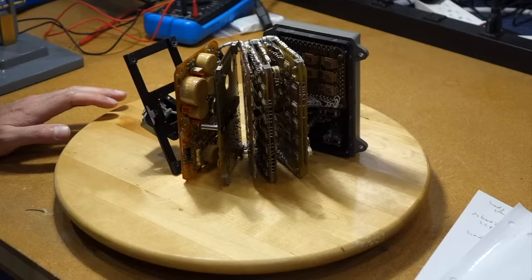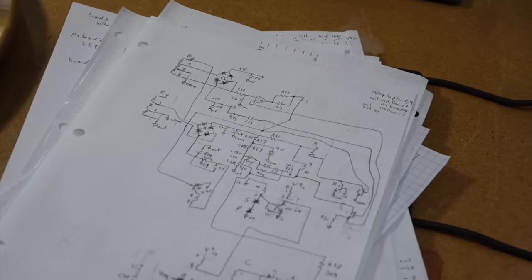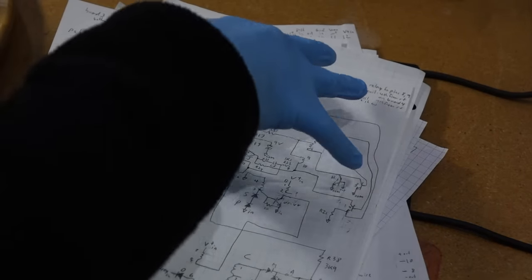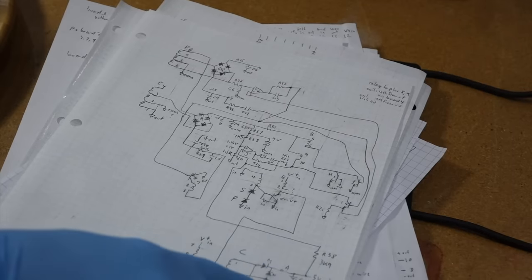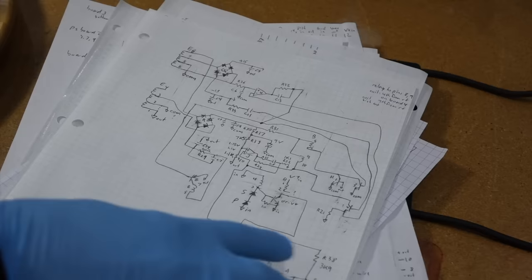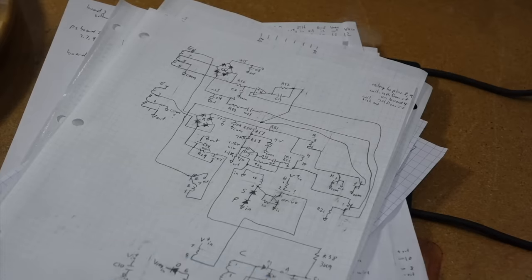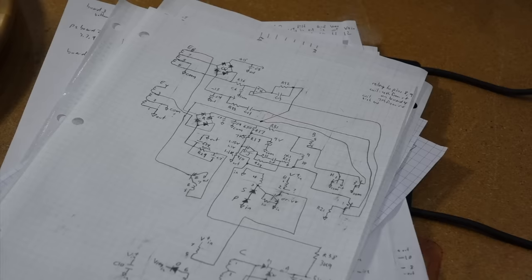Okay, and it's a switch power supply. Yeah, which makes it efficient. So this is about half of the power supply here. This is the control circuitry. And then here is the output for the 5 volts, which is a fairly standard forward converter on the output side, except they have two outputs in parallel, which is a little unusual. That's interesting. So it's maybe some redundancy kind?